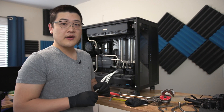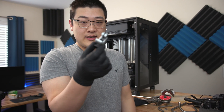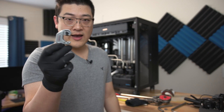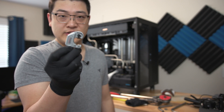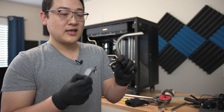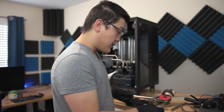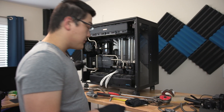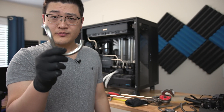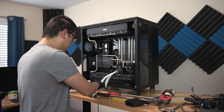The first thing I want to talk about is how to cut metal tubes. You've probably seen tools like this — it's just a metal tube cutter. However, in my experience this tool is just not strong enough or beefy enough to successfully or easily cut stainless steel tubing. It's great for copper and brass, which it did a pretty good job on the Bits Power brass tubing. But when it comes to stainless steel tubing, you really need something different.